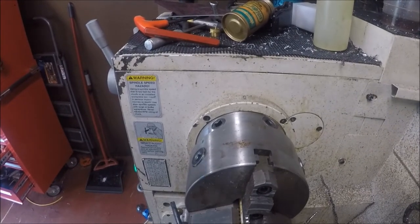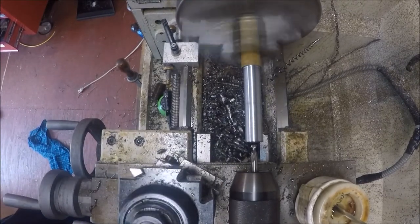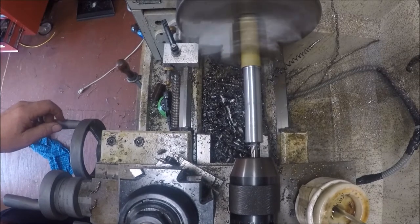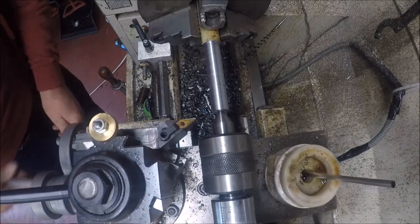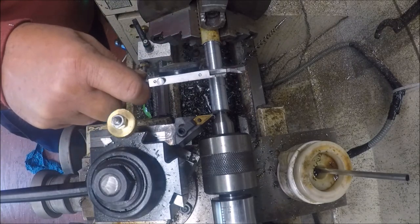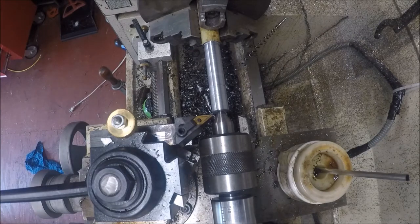Let me kind of loosen the camera up. I'll turn you down here. And there we go. Well, just turn it down. This is a job that calls for having some room to the center, so I'm going to break out my DNMG. Well, that's not, it's a VNMG actually. All right, I'm at about 660. So we want 5/8, which is basically 625.